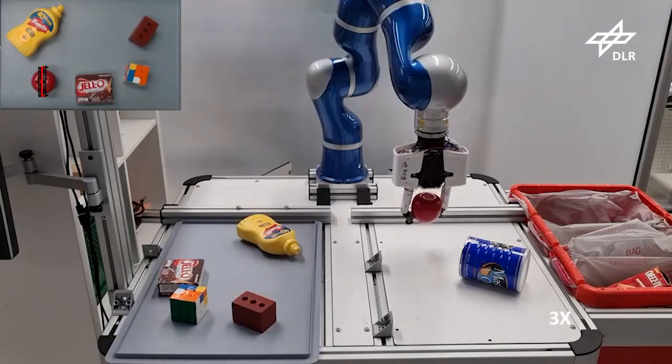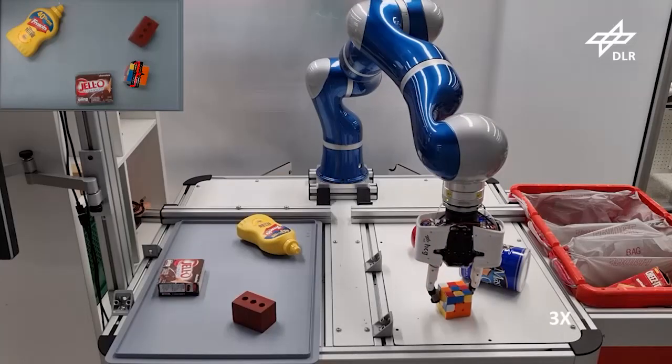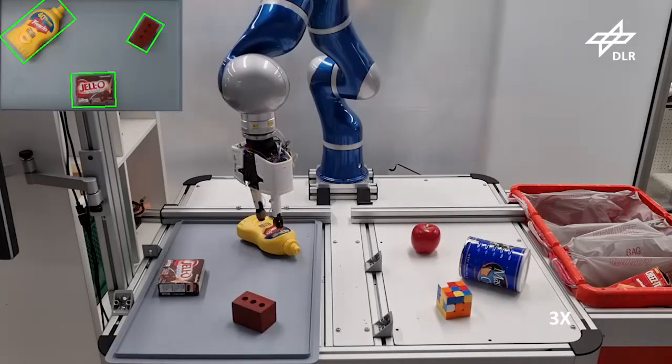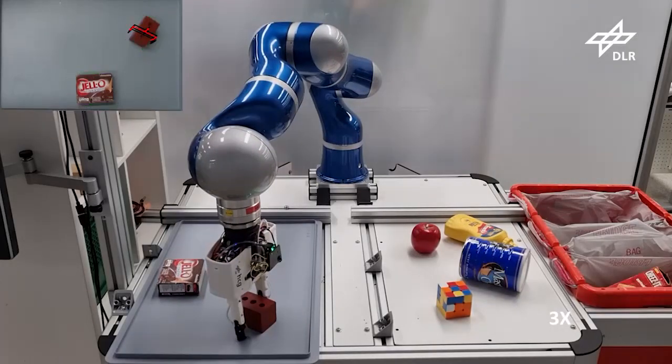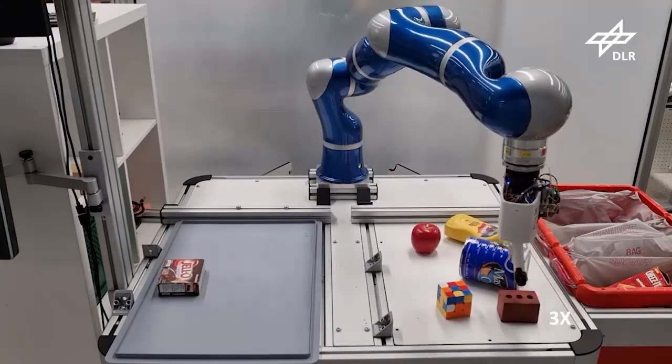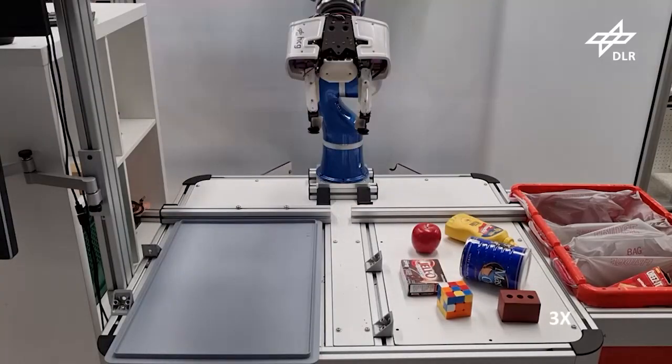In order to move toward more efficient performance, DLR created the hybrid-compliant gripper, based on the thumb modules of the CLASH HAND. This gripper allows multiple grasping modalities, including two-finger and suction grasping, thus combining the best of the two main technologies for product gripping in industry.